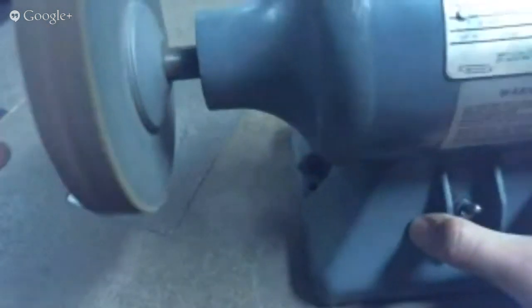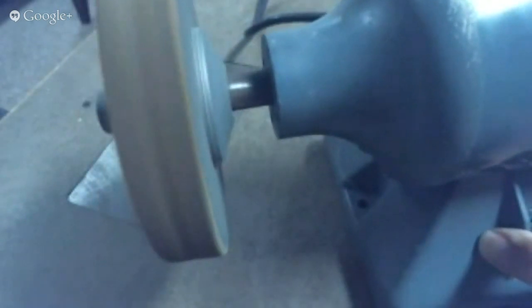This wheel is in our kit — it's the one that Vans recommends for deburring. We also have what we call the light deburring wheel, which is a gray wheel and a softer wheel. Your two options for the fourth step would be to quickly drag the Scotch-Brite around on the corner, or you can come to this light deburring wheel, which is a lower density and finer grit. Then just do the same thing — and that is just perfectly smooth.